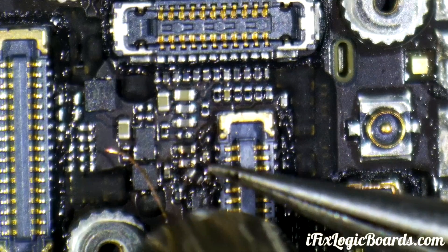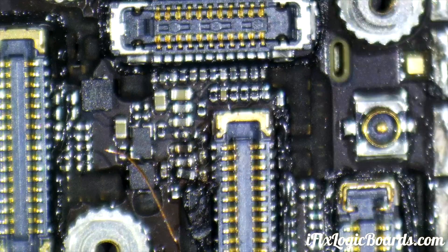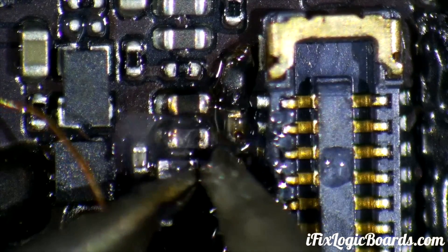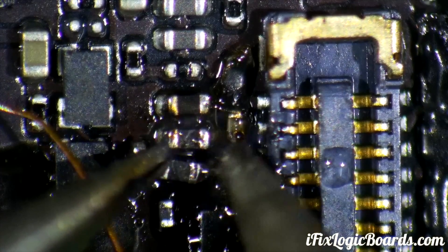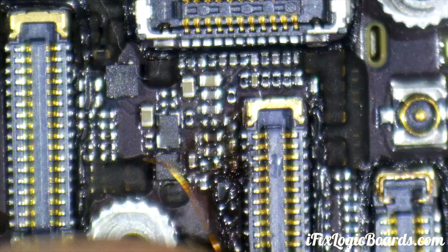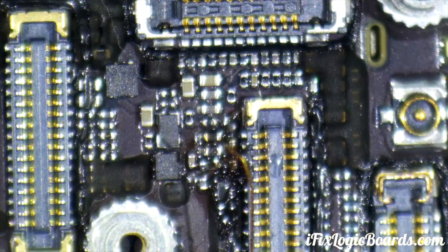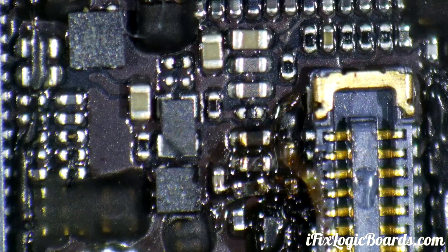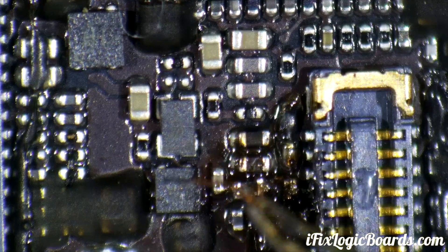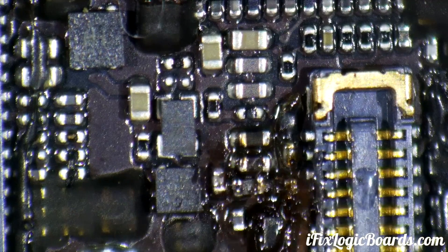You can see the filter is standing up — that's the way surface tension works on it. Now I'm going to solder this piece and create a big blob here so the filter is actually held by something. Right now we're missing the pad underneath so there's nothing to grab. This big blob should create good support, because right now it's moving loosely like that.